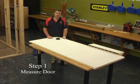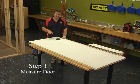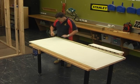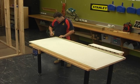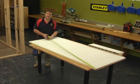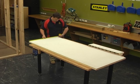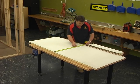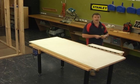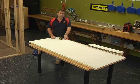In this unit we're going to install a door. The first thing we have to do is step one, which is measure up the height and width of our door. Measure the height, making sure you measure both sides. If it's a brand new door, it should be exactly the same. Measure the width at top, bottom, and middle to make sure they're the same. Write those measurements down on the door and we'll move on to the next step of working out the door jamb.